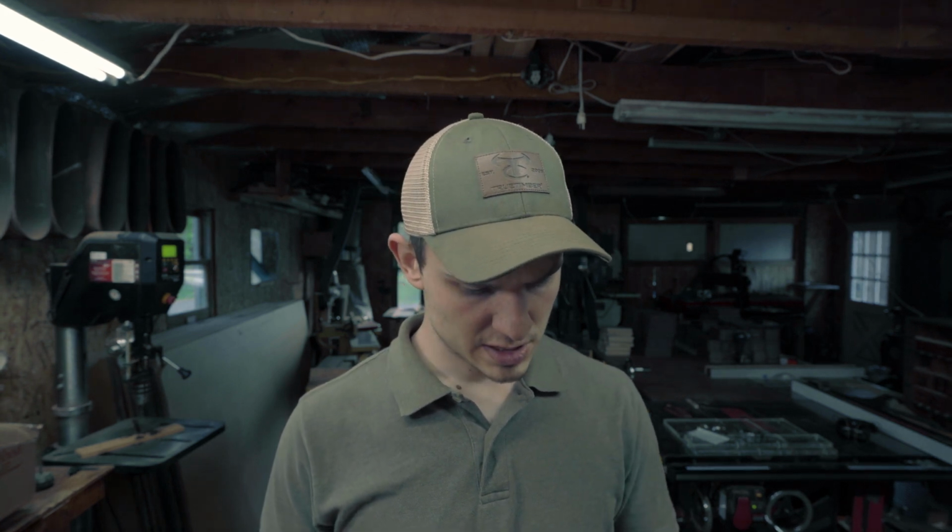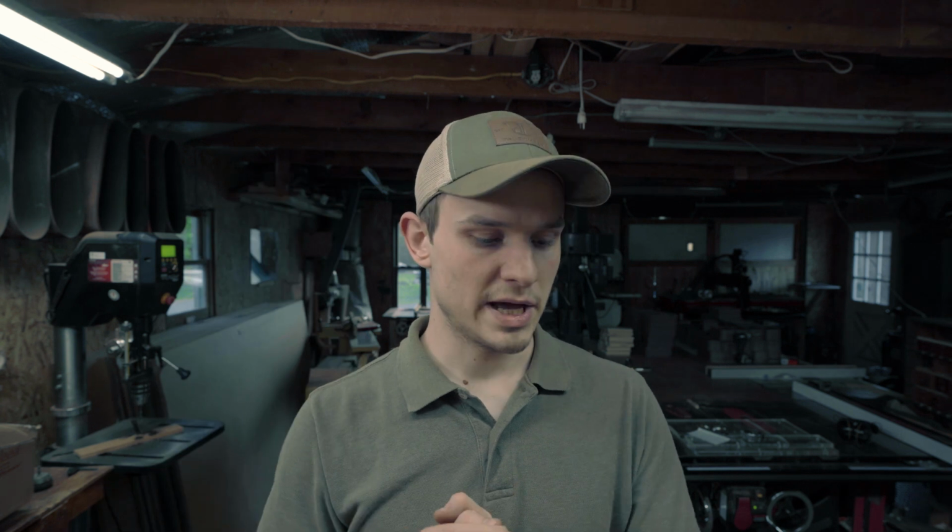So all in all, hey, we're really close. We're so close, we almost could have had a box done today. What we were missing was we didn't run the program until 2:30, and it took a little over 2 hours to run because we slowed down all the feed rates and turned the rapid movements into feed rates just so that we could be sure that it's not rapiding into the part or ruining something or plunging the head and ruining the machine. But we're going to be able to crank that up, so it's going to be much faster.